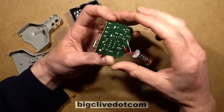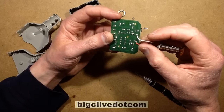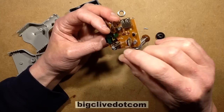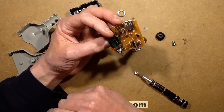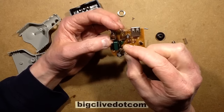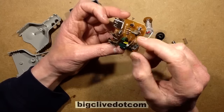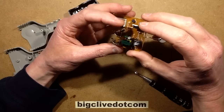Is there a discharge resistor across it? Because it seemed to go down quite quickly. They've doubled up — they've got a resistor. Is that brown, black, yellow? 100k. And this LED — that resistor is going to be dissipating a modest amount of power. So the resistor and LED are actually the discharge circuit as well as the indicator to show it's on. And that's fundamentally it.